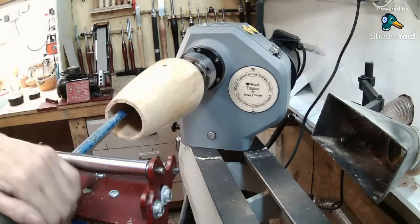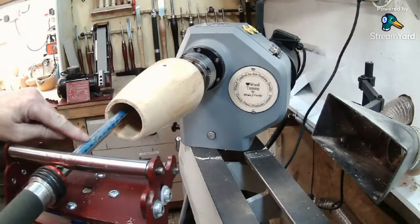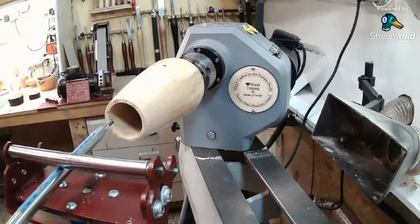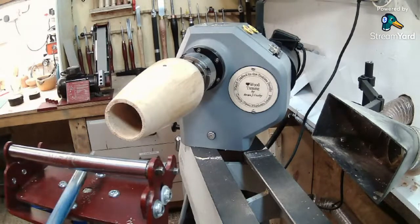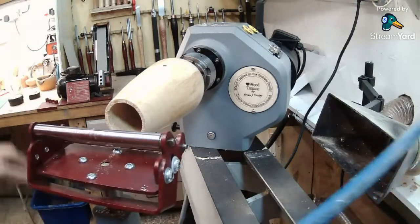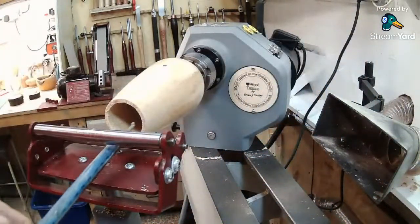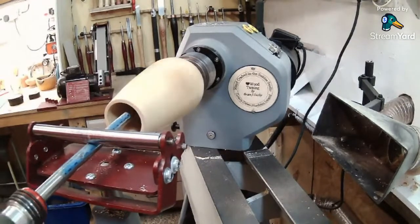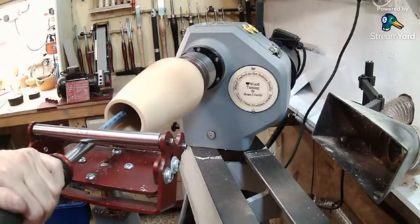So that's horizontal, the solid line, and the dotted line is the cutter set at 45 degrees. So it takes a more gentle cut when it's at 45 degrees, and it takes a really strong cut when it's at vertical. You won't believe how much wood's out of that already. When the tool's deep inside the vessel, you need a guide that you can see.